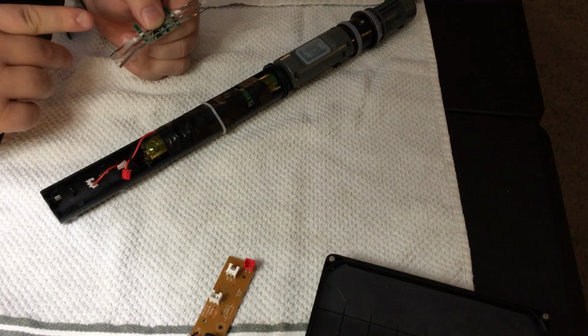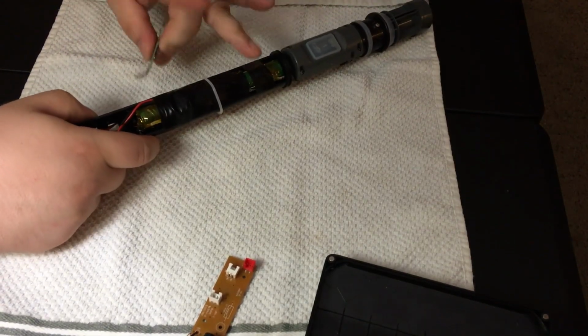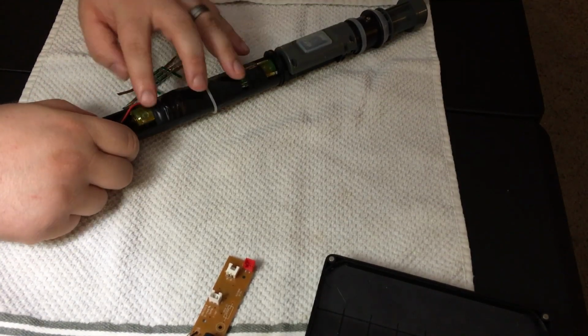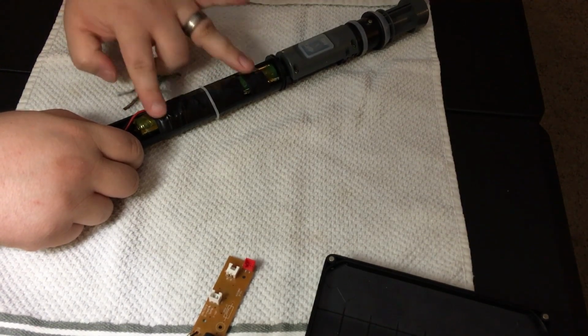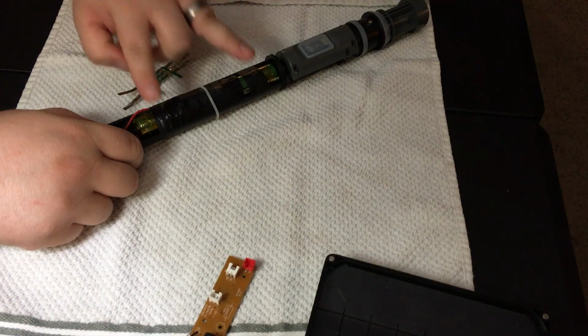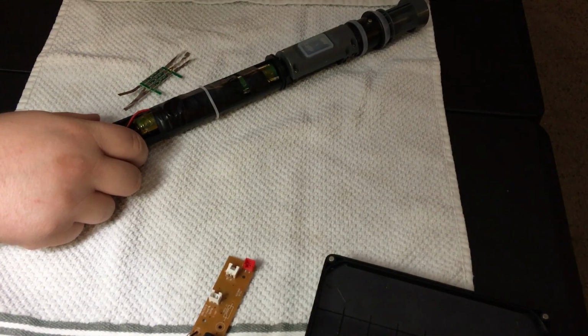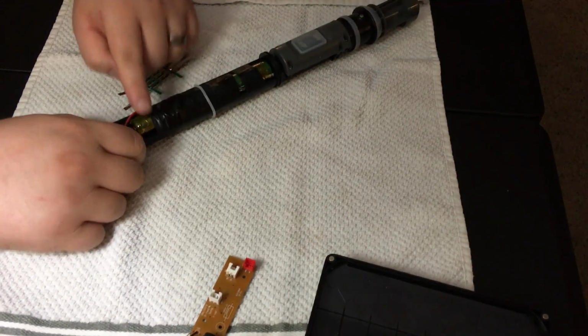They're fine, but these two have one of these each soldered on using the nickel strips, and then I connected these two in parallel, and that's important. You do not want these in series. A number of reasons. One of them is that the motor built in isn't able to handle the voltage. The motor is built for like a 5-volt max. These would be running at about 8 volts, so you're going to cause problems there.